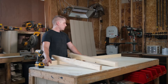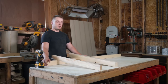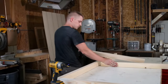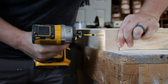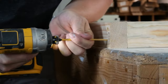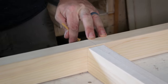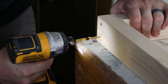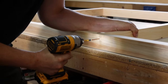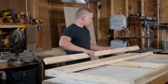I just pre-drilled the holes on the ends of the long 2x3s so that they don't split. I am now going to start by assembling the left door frame. The mark in the middle of this 2x3 is the exact center of your door. Now it's time to assemble the right door.